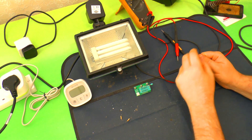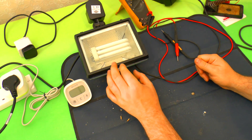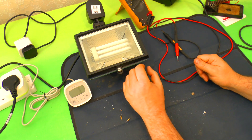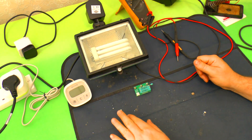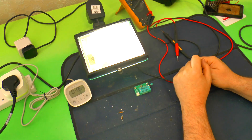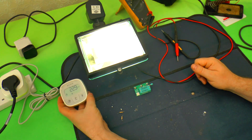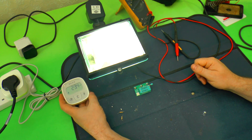I've changed those out — I've completely de-soldered and re-soldered all the joints on the board as well, so they all look fresh. I think it used lead-free solder before, so the connections all looked a bit manky and you couldn't tell whether the joints were dry or not. So I've de-soldered all those, re-soldered them — it's all nice and shiny. Replaced these two resistors, and let's see what happens. Yay! You can see we're drawing 23.1 watts — it'll climb a little bit as it warms up, but that's working sweet as a nut.